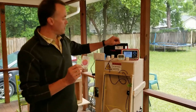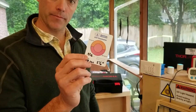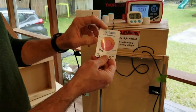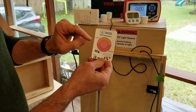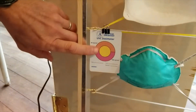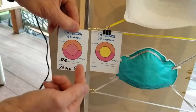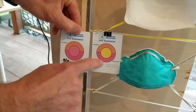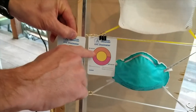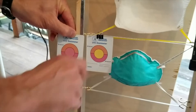This time we're going to combine the radiometer with a dosimeter card. The link for finding these cards is on the website — they're made by American Ultraviolet. What the dosimeter card does is it starts with a yellow interior to the circle. Once it's been exposed to sufficient UVC radiation at 50 millijoules, it's going to turn orange, and when it's been exposed to 100 millijoules it's going to turn this pink color.